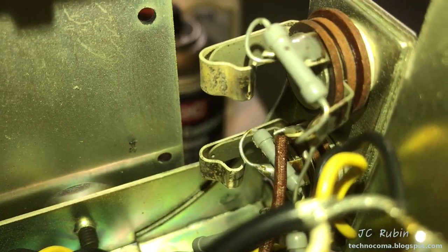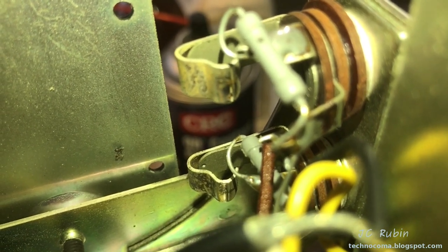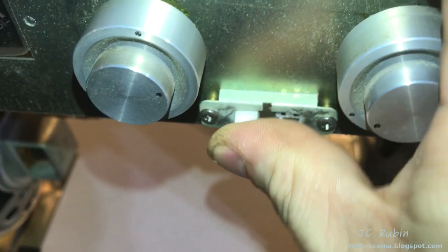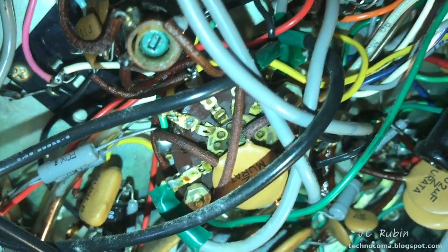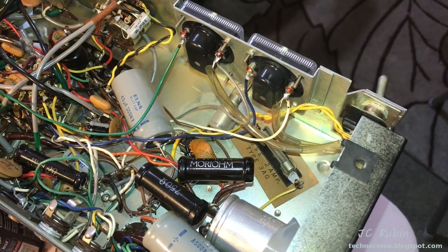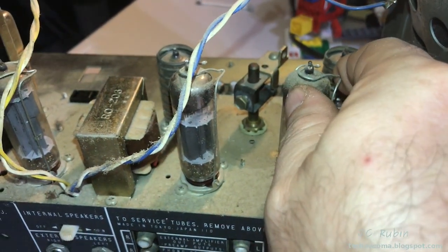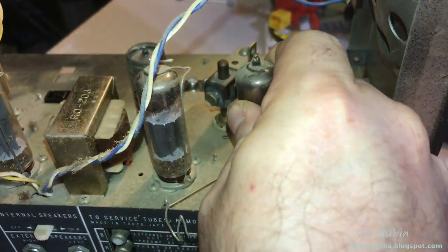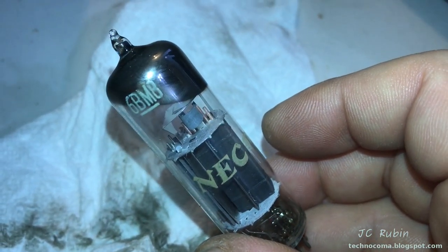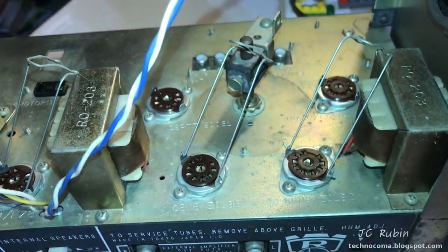There are two more terminals that need attention. I've polished those connectors — only the area that's actually going to touch the jack, not the entire connector. Found one more jack down here; this was a stereo one — I cleaned it by bringing a Q-tip through the front. The multi-function switch will need spraying and turning through all its sections. Once that's done I'll flip it back over and work on the tube sockets — pulling out one at a time, cleaning the tube, cleaning the socket, and putting them back.